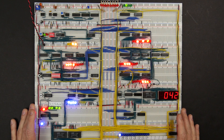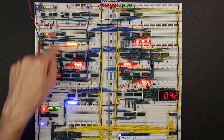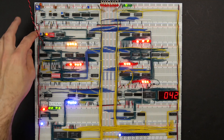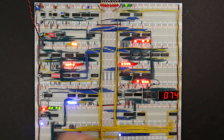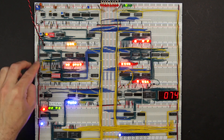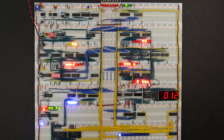That's certainly a lot easier. We can also now go in and change our data. Instead of adding 14, let's say we want to add some other number — I'll flip some random switches and set that number in. If we go back into run mode and just reset, now we get a different answer because we changed our inputs. We can go back, go to the other operand, and set some other number and rerun the program. We got 12 that time. That makes it a lot easier to try out different things and reprogram without having to fuss around with resetting each module individually.